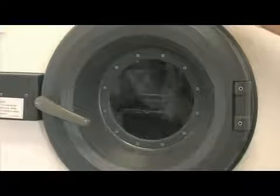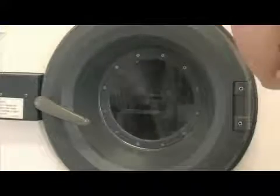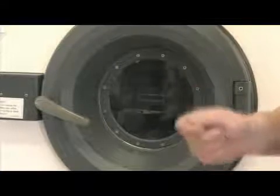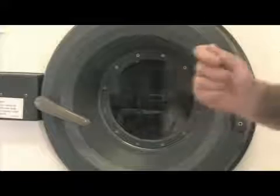Well, you heat it up to turn the solvent into a gaseous form. That way it goes through our refrigeration unit and our condenser and turns it back into a liquid by cooling down rapidly. It cleans as a liquid. It goes in there as a liquid.